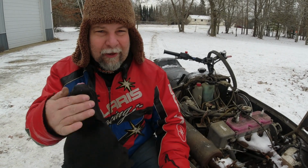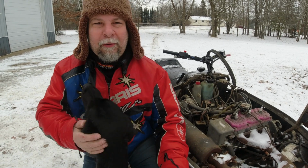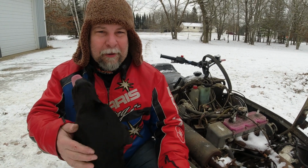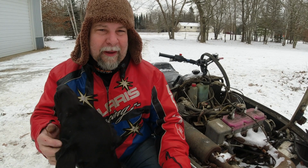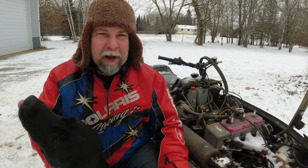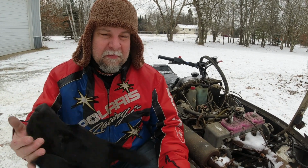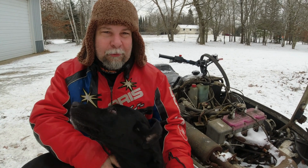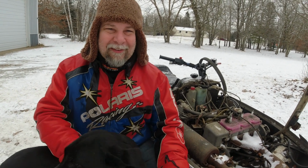All right, it's a couple hours later. I've been mulling this over while I wait for the boys to show up today. And I did some more checking on the sled. Middle hole is at about 60 PSI. So this motor's coming out no matter what. If it's got a good crank and it gets Dennis up and running for the season, that's awesome. Gives me all summer to look for parts. Doesn't mean this sled's dead or parted out. Just borrowing parts, not necessarily parting it out. So that's what we're going to do. Hopefully this crank is good. We'll know when we know.